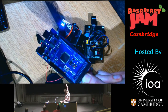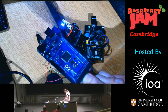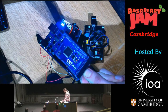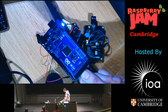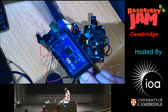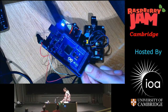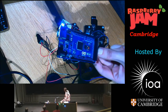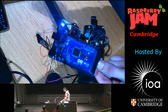Basically that black square in the middle is the microprocessor. Everything else on here is the support components — the protective circuitry that more or less prevents you from blowing it up. Right on the end where my thumb is, there's a connector that's actually bigger than the one on the Raspberry Pi, and that's just one end. There are two banks connected to the other side as well — mixed digital and analog, voltage at both 3.3 volts and 5 volts, plus USB-B and low power so you can run from batteries for a long time.